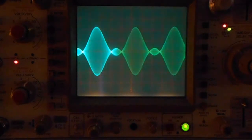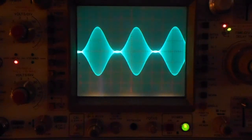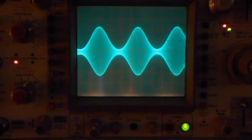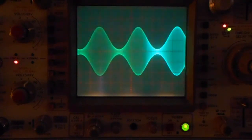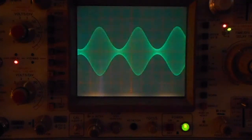And then we'll bring it back up and pass through a setting of 100. Now we're exceeding 100, and you can see that the negative peak effect is still there and it's enhanced somewhat, while the positive peaks are still allowed to get all the way up to the point just below the threshold where the DAC begins to clip.